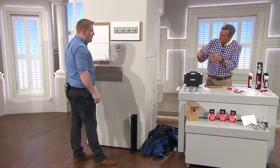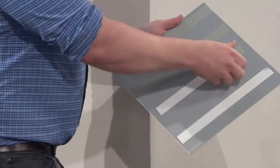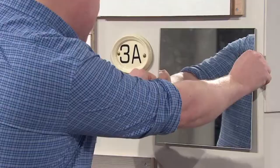If you use something like a polyurethane to stick a mirror up, anything that's solvent-based — and this is why we can do it with Ultratape and you can't with other products — solvent-based products start to eat the back of the mirror. No problem with Ultratape. Place it into position, make sure it's nice and level, push it to the wall, give it a bit of a push. We've now bonded the mirror up in a few seconds. No problem at all.